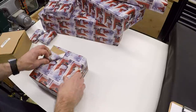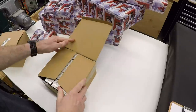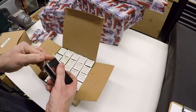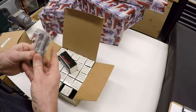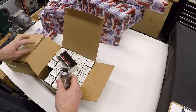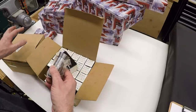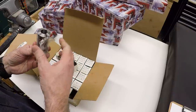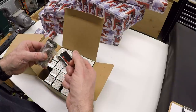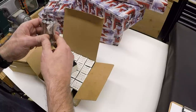And in this very similar size and weight box, we have metric collets. We get a lot of flack for using imperial measurements here in the U.S., and we get our suitable punishment — we end up buying everything twice. I've got a set of imperial collets for holding imperial stock, because that's generally what we find in hardware stores and metal suppliers around here. Metric diameter round stock is a specialty item and it's a lot more expensive. But I'm always having to grab things that are metric — like I'm going to modify the scroll chuck key for the collet chuck itself, and I need to hold it in something. It's a metric diameter, so having a set of metric collets makes sense.